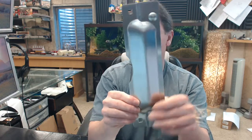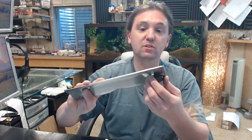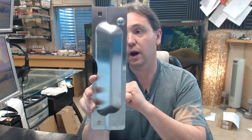Now, what this is, the 341D is an outswing latch protector. The US2C means two things. It means it's made of steel and that it's zinc coated for corrosion resistance, a good corrosion resistant finish. Certainly complements stainless steel very, very well. Not exactly stainless steel, but certainly complements it very well. US2C or zinc coating is not significant. It's less than stainless steel. It is a very good option.